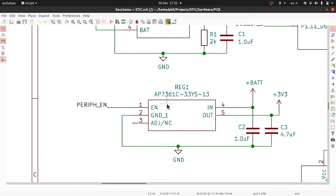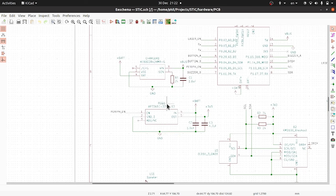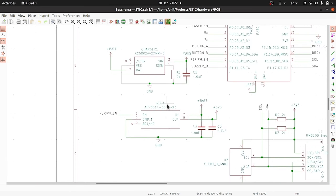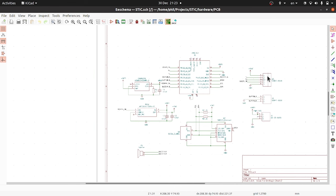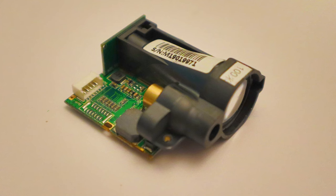We've also got a 3.3 volt regulator to provide power from the battery for all the other bits and pieces. I deliberately chose one which can be enabled or disabled, so you can shut off power to all the other sensors and the display without turning off power to the main microprocessor — it just makes life a little bit easier. As it turns out I'm using quite a big chunky LiPo battery and the charger built into the Xiao would have taken forever to charge it, so we've actually got another LiPo charger built in as well. There's also a header for connecting to the laser module.